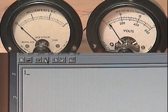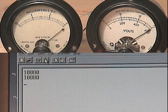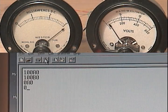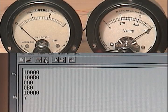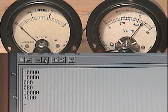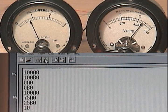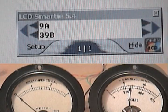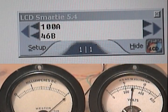The device is designed to work with LCD Smarty, an open-source utility that shows system stats on a screen like this. It's easy to set the gauges — we can test it out from a serial terminal. Enter the number to display, followed by a gauge to show it on: A or B. That's it — no enter, nothing else. The device will respond with zero. With a bit of finessing, we can get LCD Smarty to send CPU and memory stats in the same format.